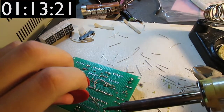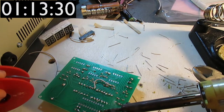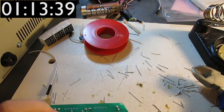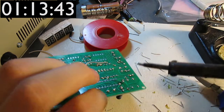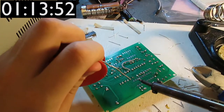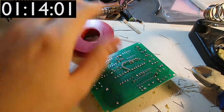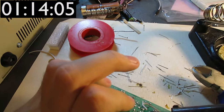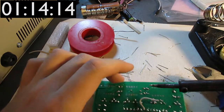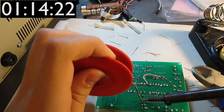So I'm gonna have to try and carefully solder the pin one on here, and on there. Oh, I've just resoldered that pin, so that's alright. And then push this in, reseat that, go off camera quite a lot, and solder this opposite pin off here, but with way too much solder than I needed. And push this in there. This happens all the time. So I soldered that one in, and basically now it holds. So I just go and solder all of the other pins on here.